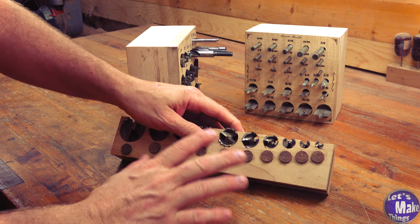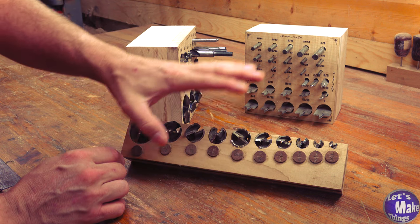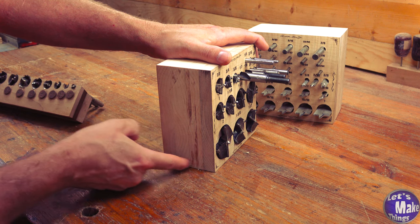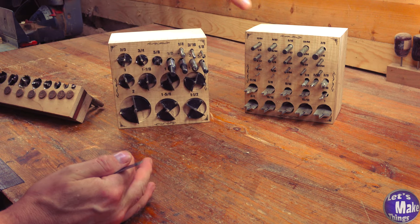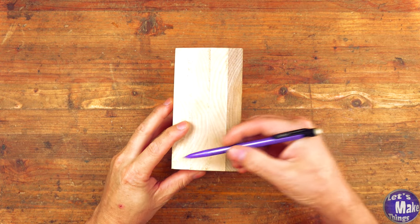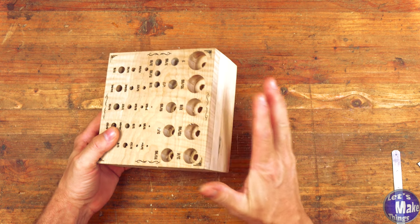Going back to the Forstner bit set I've had for a long time, you'll see that I've got it at an angle — it was kind of by accident that I discovered I liked it this way, but the good thing is I can see it from this angle or from many other angles. So with these I'd like to do the same thing. I'm going to come to the back side and go 3 and 3/8ths from the bottom and draw a diagonal across. These are 3 and an eighth inch wide, so you might need to adjust, but I found 3 and 3/8ths works well because it won't cause a conflict with the spade bits and it's enough that I can see everything. I'll flip this on its side and carry that line across to the front point. I'm going to take this over to the bandsaw and cut it off.